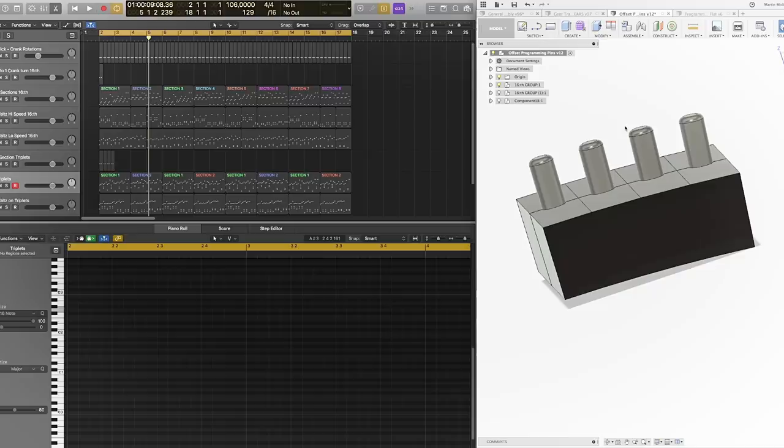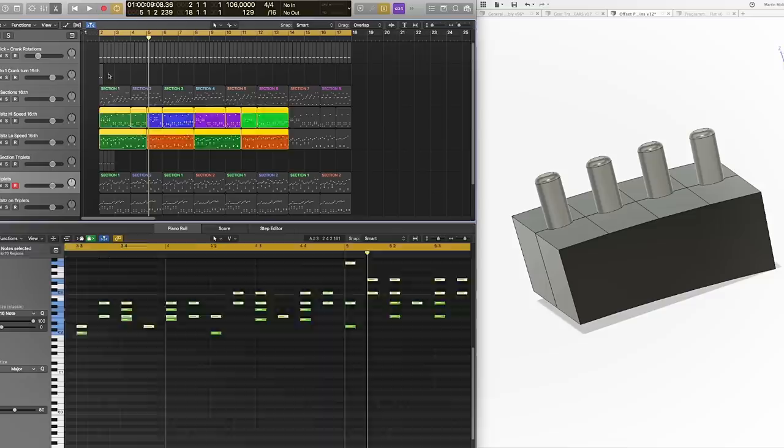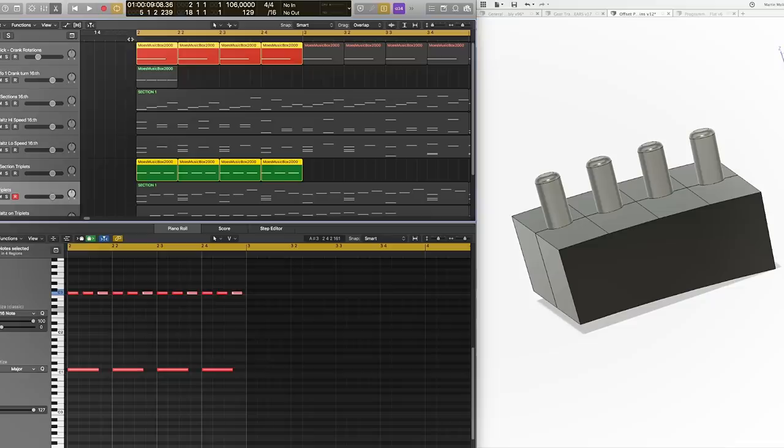So the first problem we get when we divide one crank turn into four like this is that waltz songs don't end up periodically with the loop of the programming wheel. The second problem is that we can't play triplets. A triplet is when you divide one crank turn or one beat into three. It sounds like this.